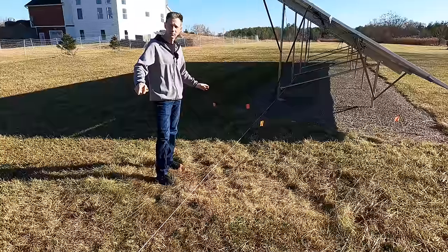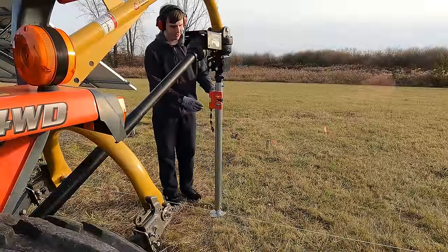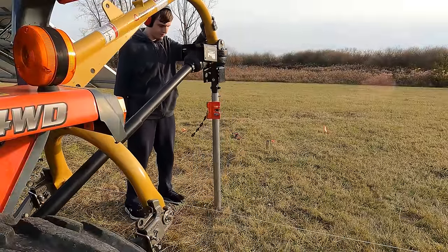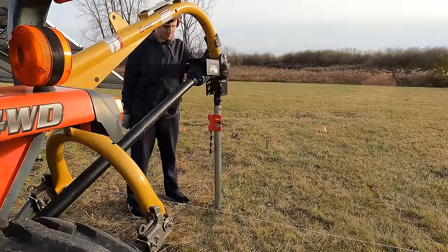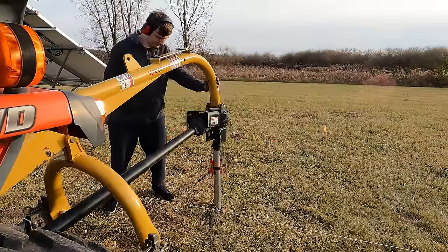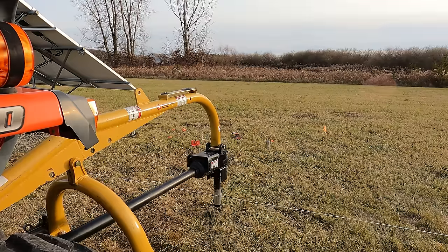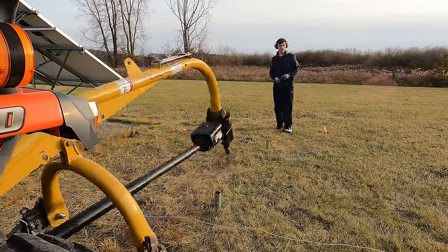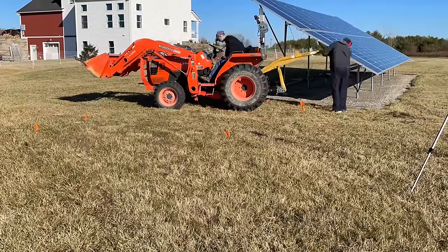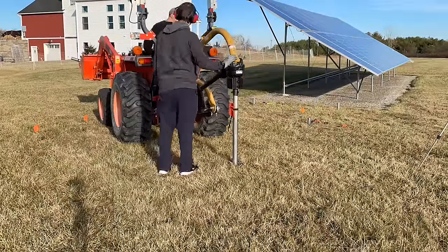Now I've marked all the locations for my posts — now we just need to drill them into the ground and set a rack up. We placed the point of the screw at the flag position and used a magnetic two-way level to make sure the post stays perfectly plumb as we drive it. Post hole diggers move on an arc, so we paused every once in a while and adjusted the tractor position to keep it plumb all the way down. It doesn't have to be perfect, but if you're too far off, the vertical post will tilt off angle and make it difficult to assemble the rest of the bracing. If your ground is fairly flat, you can use the tape method to set the height relatively close, then use a string line from your first post to your final post in the section to set the final height. There is some height adjustment available in the purlins if you're off, but try to get it within half an inch.